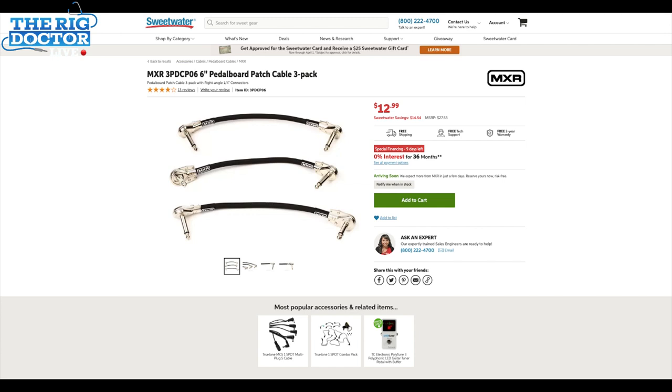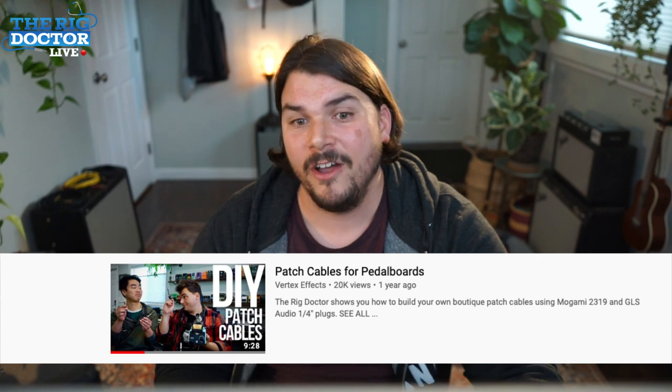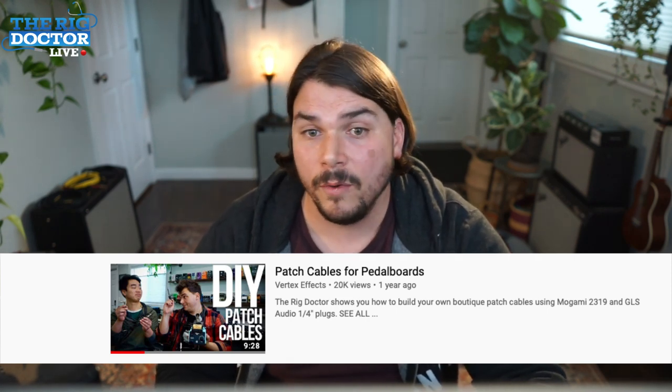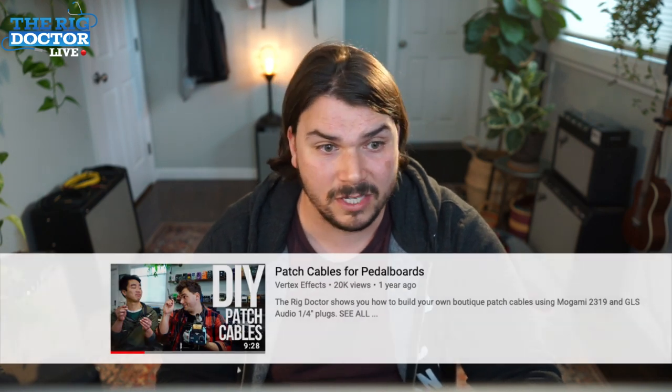Maybe they are using Mogami, I'm not sure. But it definitely is very well built, and for $12.99, it's certainly going to be a more reliable option than any of the solderless varieties. It's going to be much more bulletproof. You always want to have a gas-tight connection. I've talked about this ad nauseum. You can watch my video about patch cables for pedal boards, and we talk about this to a degree. We also give some soldering tips, which I'll talk about in just a minute.